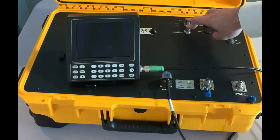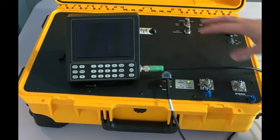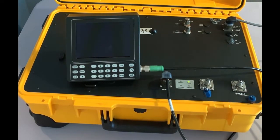These are going to be your emergency vents. Note that this unit is fully automated. You will never have to use those vents to actually regulate pressure and vacuum on this test set. These are only here in case of emergency. This will be only in case of loss of power in your hangar or malfunction of the test set during a check, and you will have to ground your aircraft